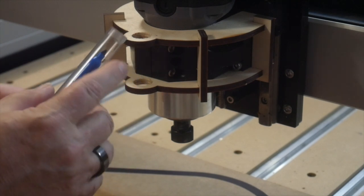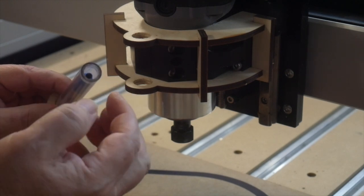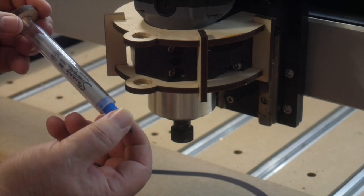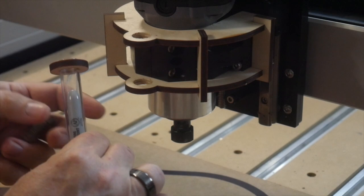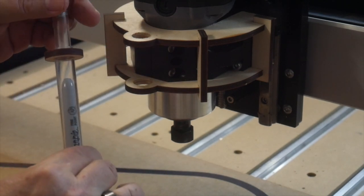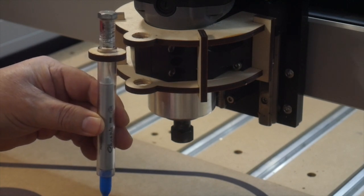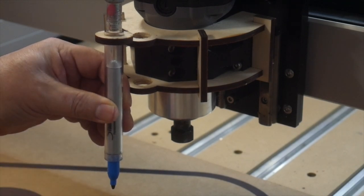There is a clear holder, and inside it there is a slightly smaller plastic ring that I cut with a laser and pushed in. It catches the ridge on the pen and makes sure the pen stays in there. The weight on top has two purposes: it catches the back end of the pen and stops it from wiggling, giving a nice clean line. It also provides a consistent weight on the pen each time. I found that a short 3/8 bolt seems to work pretty well.